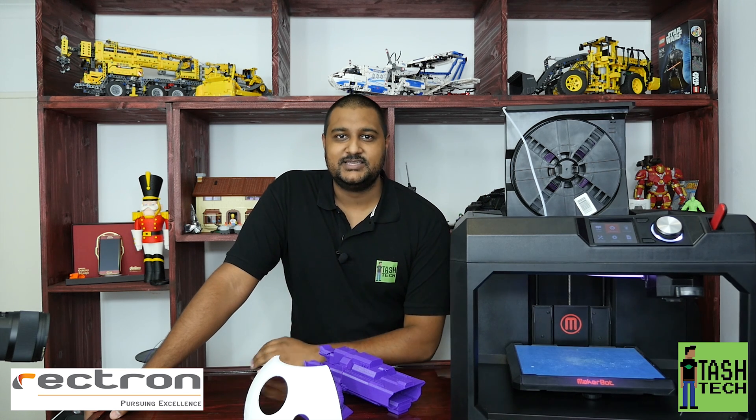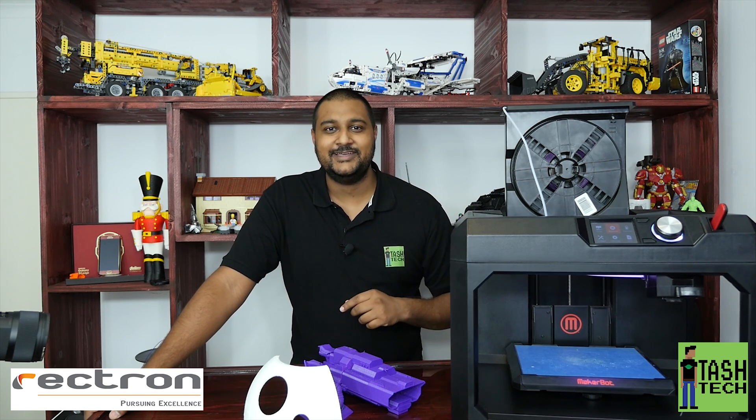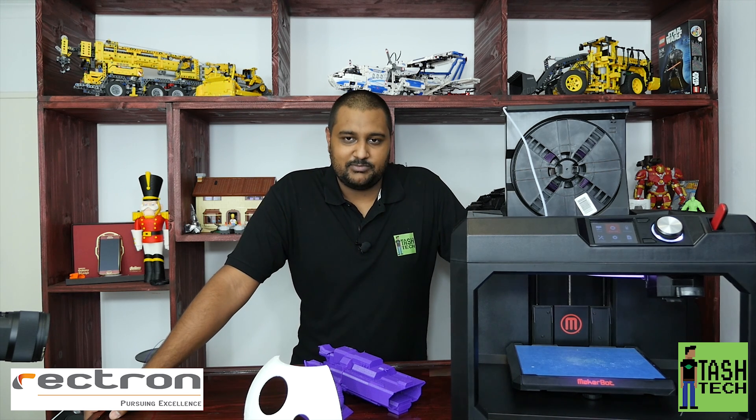I can understand why people get frustrated. A lot of people I come into contact with say these printers are so expensive - that's because they're looking at MakerBots and Ultimakers. It's those type of people that are complaining, because they don't have a background of understanding how it works. I would say: if you want a 3D printer, make one first. They're cheap to build as a kit, and when you make it yourself you're going to understand G-code, heated beds, RAMPS - all of that. From there, you can easily troubleshoot these machines. I'm not saying don't buy one - go buy one. But buy a RepRap too, because I constantly curse at my RepRaps. Even though we had issues with this one, I was overjoyed to fix them because they were fixable and it worked afterwards.